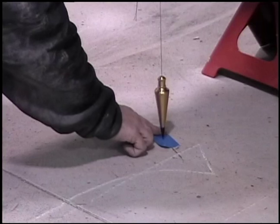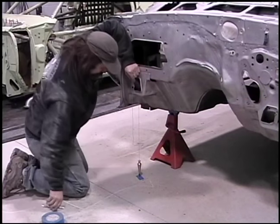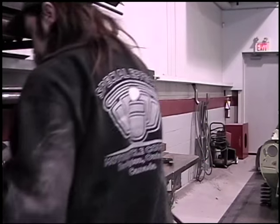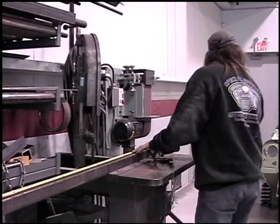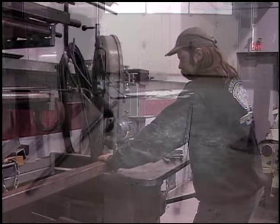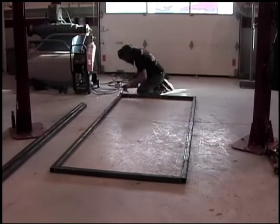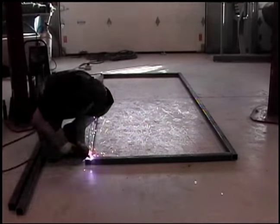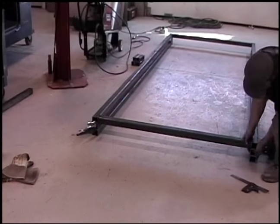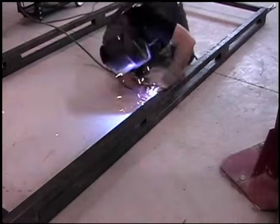You have to. It's simple, you can do it in a day. So what they started with is they dropped plumb bobs down from the pickup points on the chassis here, and then we're going to mark the floor. That gives us the outside dimension, or where we have to be. From there, we're just going to square off the tubes — two-inch tube, one-eighth wall thickness. We cut them to length, lay them out on the floor, and start welding them together. We're actually going with two layers of square tubing to make it more rigid, because one layer will flex in the middle just like it would on the jack stands.